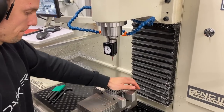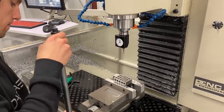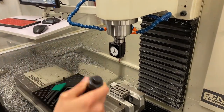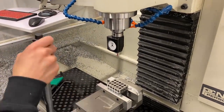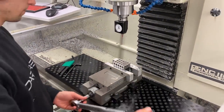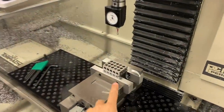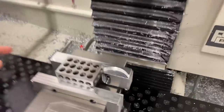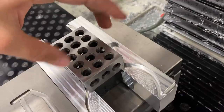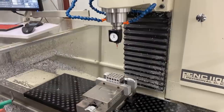Setting up here to do the side two finish machining for the outer trailing links. And what Keegan's doing here is basically zeroing the machine with the soft jaws in with a preload installed. So he's got this 1-2-3 block in the soft jaws. You torque that down to a specified torque, and there's a little bit of flex that occurs in these jaws. And because we're picking up our zero point off this little circular feature, if these flex, that's going to alter the position of that zero. So we want to account for that when we clamp the jaws down.